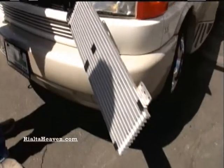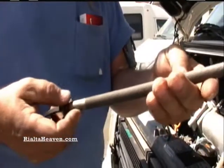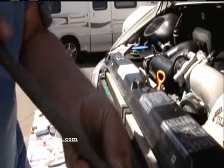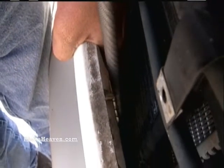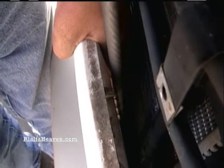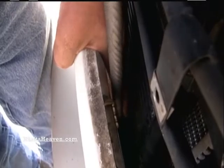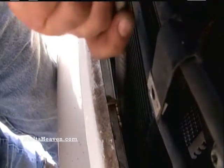Basically this is where your cooler will hang if you decide to change spark plugs — hang it off to the side, then you can tilt your radiator to get the spark plugs in. That's where the rat-tail rasp comes in. I don't know the exact size or brand — it's about half-inch diameter and it's a rasp, not really a file. This goes right in beside where you need that extra little notch in the plastic. Some people are squeamish about doing this, but it's got to be done — it's plastic, it's not extremely difficult. Try to keep it as vertical as possible.